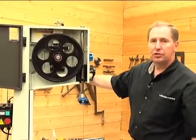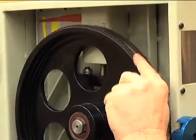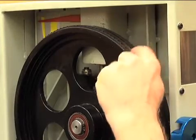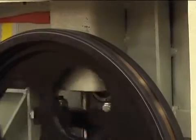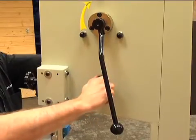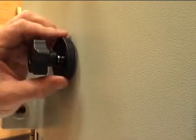I'm going to move it forward and back a little bit using the tracking knob. I've adjusted the bandsaw so that the blade is a little bit more toward the front of the wheel to demonstrate tracking. Normally you want the blade right in the center of the tire — middle of the blade right in the middle of the tire. In order to adjust it backwards, we'll spin the wheel, unloosen the lock knob on the back side, then take the tracking knob — as we spin the wheel, turn the knob clockwise to move the blade backwards. You'll notice very gradually that blade starts to walk its way back and now it's pretty well centered in the bandsaw tire. Once I have it where I like it, I'll lock the lock knob so the tracking knob doesn't turn, and we're ready to go to the next step.